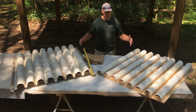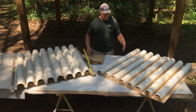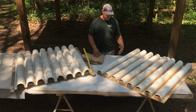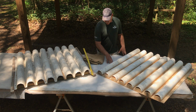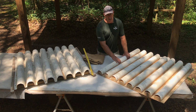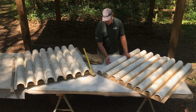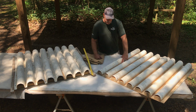And the jute material that's laid out is 96 inches, just like you'd have for a reef prism. But as a result of the corrugations, that 96 inches all compresses down to be within a 4-foot length. And so we end up starting off with a piece of plywood that's 4 feet by 4 feet. And then I used a 4-inch PVC drainage pipe, cut those in half, and then mounted those on a piece of 3/4 inch wood, and then spaced them equidistant with a 2-inch spacing in between.